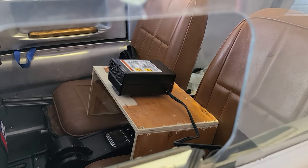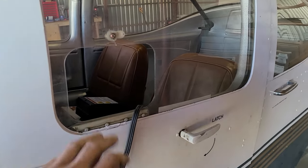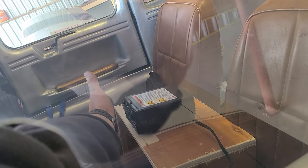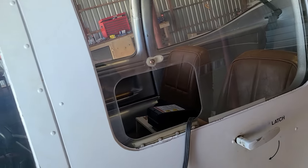I send a text message to the next channel, which turns on the battery minder and the space heater in the cockpit. We see the light switch on on the next box, and I got a reply that it turned on. I've made a platform to hold the heater up off the seats and the cable runs through the port window on my side window. I flip down the flap and I can feel the heat coming from that heater. Everything is function-tested and working.